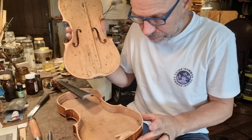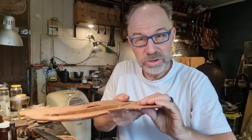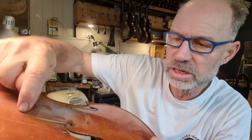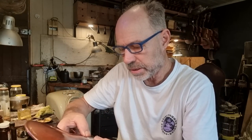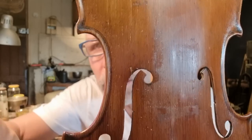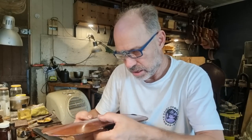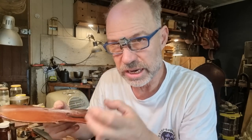It had some bugs inside it at one point. I'll be able to clean that out. So here's the problem. First thing I'm going to do is squeeze everything gently back into place. This crack here is a difficult one because it's actually angled at this angle, so it's going to be quite difficult to glue. I have to put clamps on up and down as well as sideways. I'm just realigning the cracks to make sure that they're all just sitting flat. I'll probably glue the middle one first because that'll stabilize things a lot.